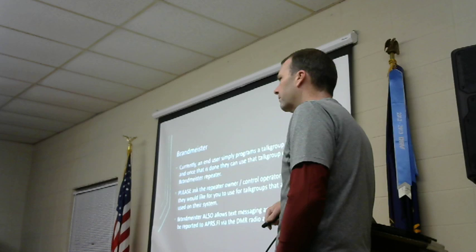Yeah. So when you do the PTT to tell the repeater that you want a different talk group, is there a timeout, like so many minutes? There is, and that's adjustable on the Brandmeister dashboard, but the default is 15 minutes.